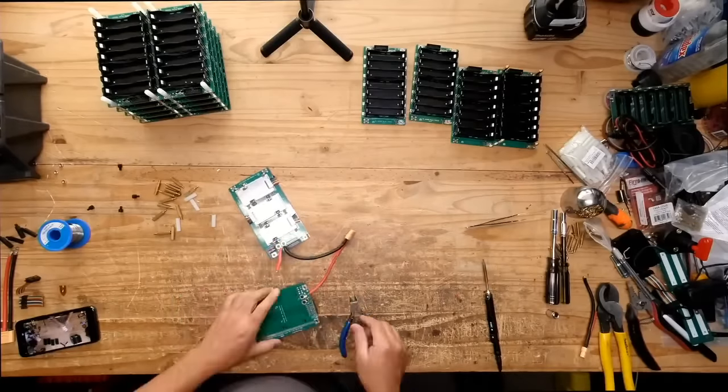Maybe if you get 200 watt panels, maybe it'll work up to 380 or whatever it is that it maxes out. And then if it's cloudy or the sun has too much angle, maybe it'll keep the 380, the max charging rate, for longer. So maybe that's the only time I think it would be worth having those bigger panels, right? But I wouldn't go too much bigger, because then you pay a bunch of money for stuff that you're not using. And also they're bigger.